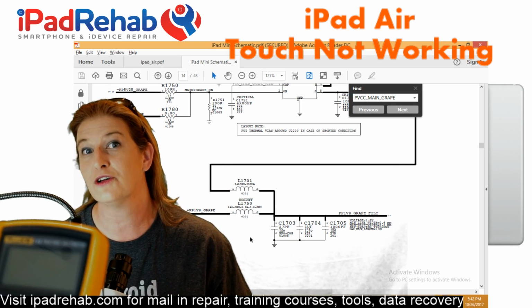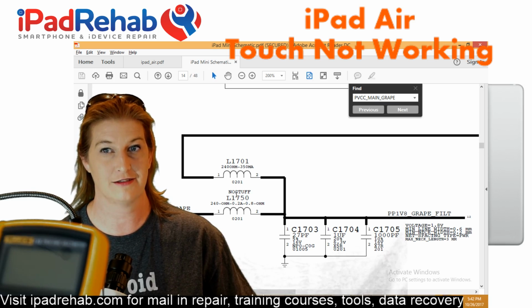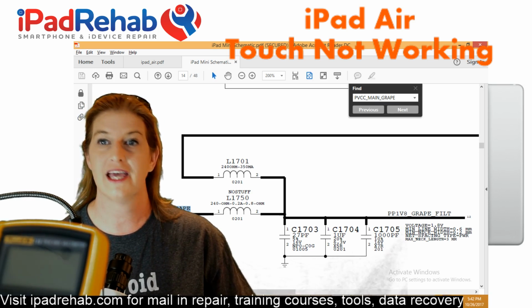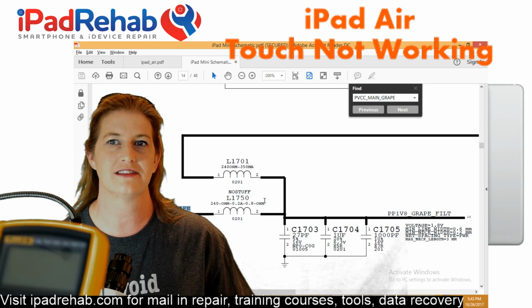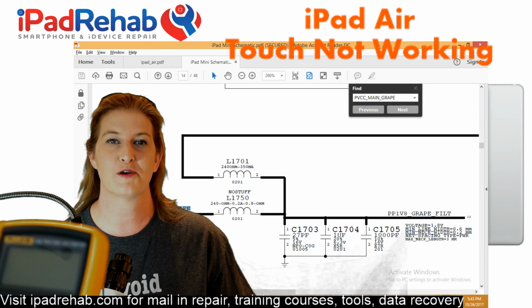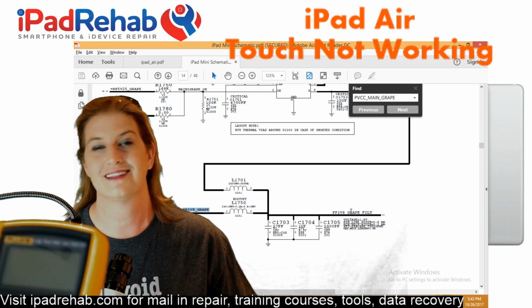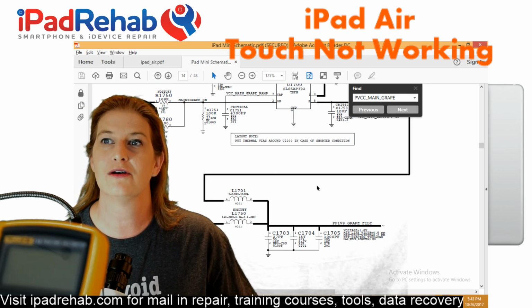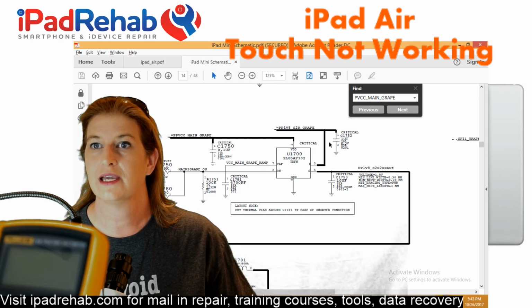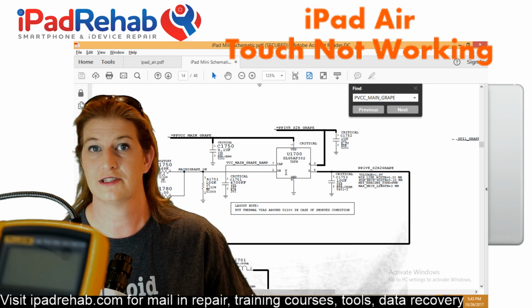Now here's what's interesting about this. If you look at the schematic here, see where it says no stuff? What if that wasn't no stuff? What if I stuffed it? If I stuffed this, then I would take PP1V8 grape and just make it become PP1V8 grape filter. So there was a point in time, at least during troubleshooting, where that was a plan. And then later they decided not to do that. So this got edited to no stuff. So I think that it's perfectly valid to say, well, you know what? Let's go back to the old days and make PP1V8 grape become the touch power line, the 1V8 touch power line. See what happens. Rather than no stuffing this and making the whole line depend on this chip and its input, so that instead PP1V8 grape has to plug in and tell this to turn it on.